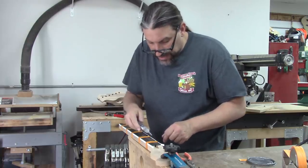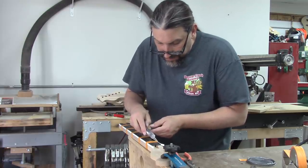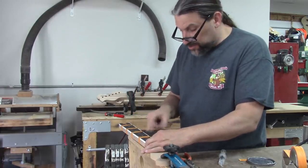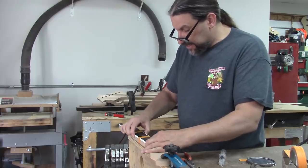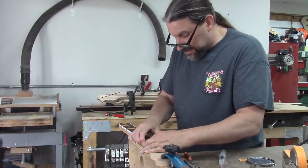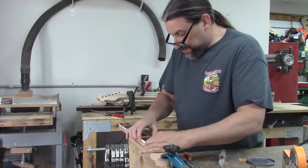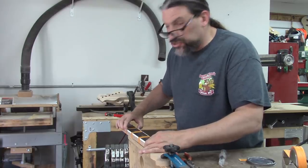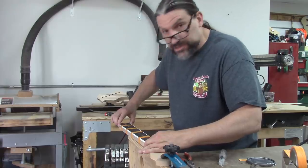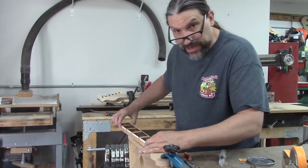We wanted a 10-inch radius, so I made the fret slots a little deeper because I knew we would have to scrape the binding crud that gets in the slots. We'll have to scrape that out of there because we've got lots of good stuff coming for this neck — I can't spill the beans yet. But I can tell you that there's no way anybody else in this contest stands a chance with what Chris and I have come up with. Let's let that set up for a couple hours and then we'll come back and I'll show you what's going on.